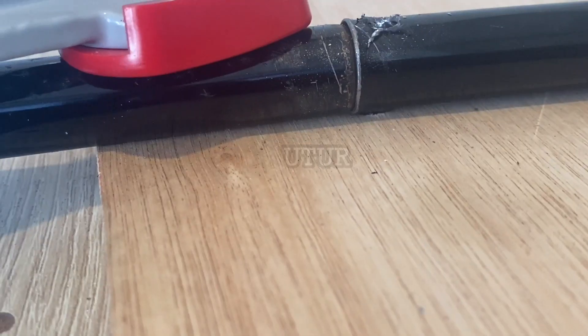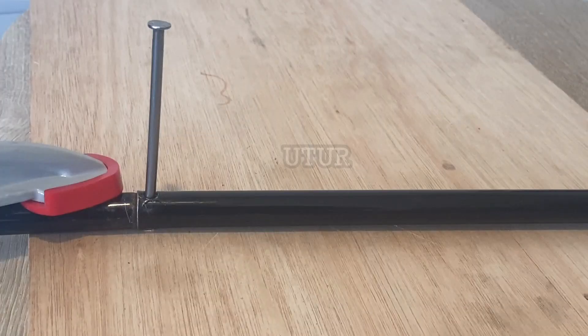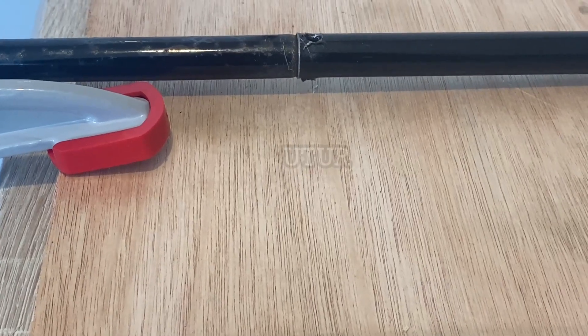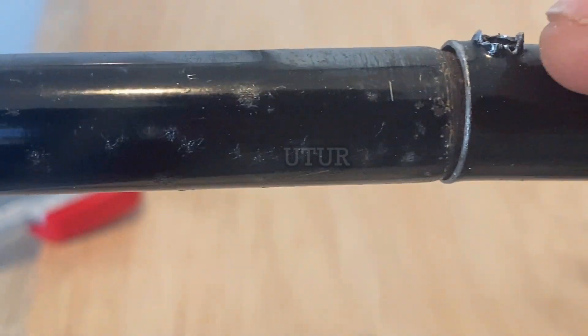Flip the connecting rod over and finish off the hole to its final size on the underlying side. You can see the hole that's been drilled onto the hardwood plywood — that's testament that we've been able to navigate through the underlying side of the connecting piece onto the scrap material. Center punch the underlying side and then open up the hole to its final size. Utilize a plier when necessary to get the center punch nail out of the scrap piece material.